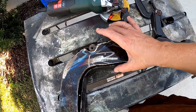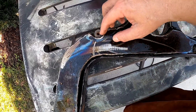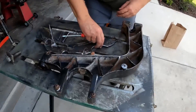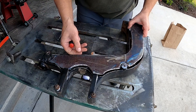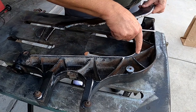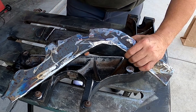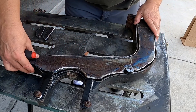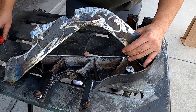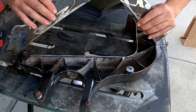We're going to clean this up a little bit and get it on the belt sander to fit it down inside. When I drop it in, it falls down onto the webbing - these parts here. One thing to look out for is these webs right up to the top edge, so I had to groove out spots for those webs so it sits down. We know the weak point is in here, so I'm going to put my own webbing on here - one here and one here - to stiffen it so it doesn't try to bend in this direction.